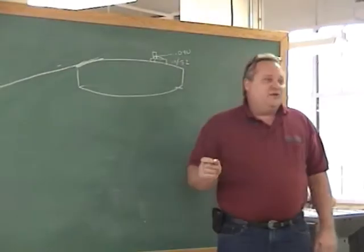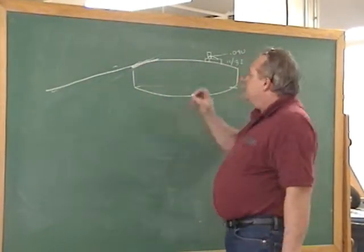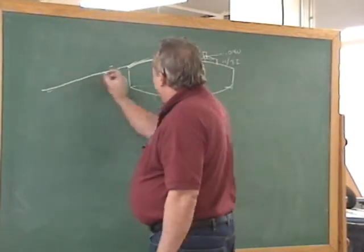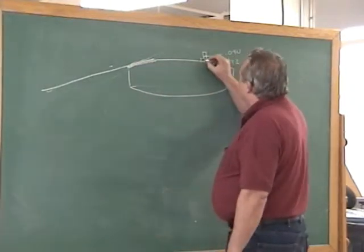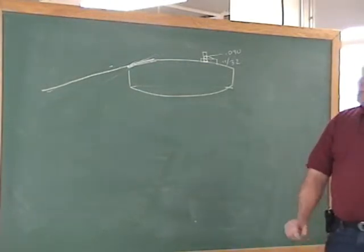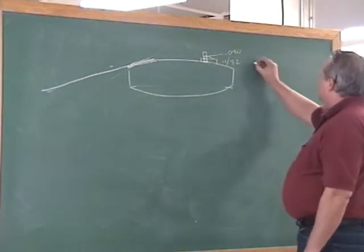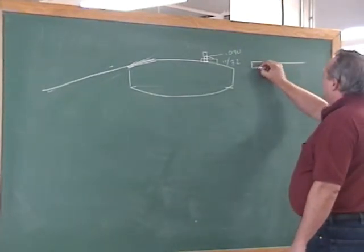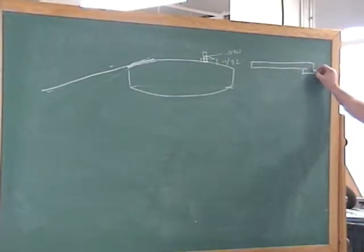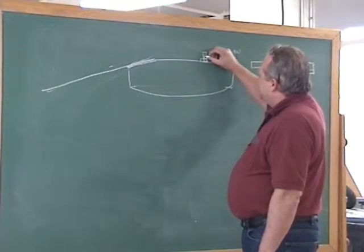A 28-foot radius is what Martin uses on their braces. If you radius this at 28 feet, it's going to be too tall here. You're going to be over. If I lay a straight edge right along this line, I want a gap of 90 thousandths right at the bridge position. That's ideal. If you make yourself a straight edge and you glue a 90 thousandths block right here on the end, you set that block in this position.